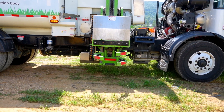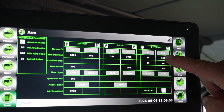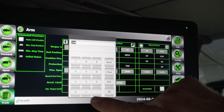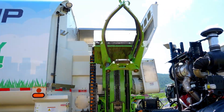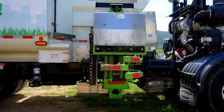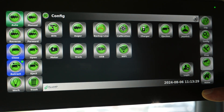If the three end points of the grabbers are not aligned when closed, you will need to navigate back to the lift arm's option screen and adjust the value in the in-position box under the closed column to align the grabbers' end points while closed. After making final adjustments and confirming that the lift is not hitting any other components, try running the lift at full speed.